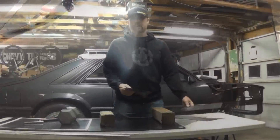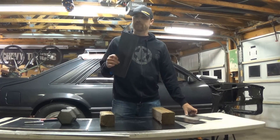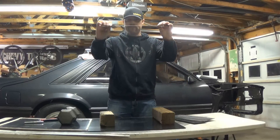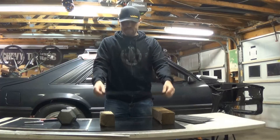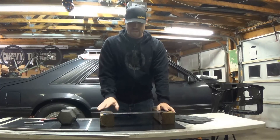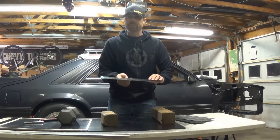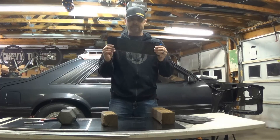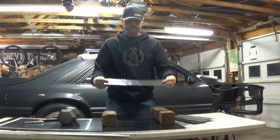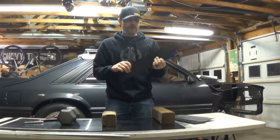I have the one piece cut into three pieces. All of these are just four layers of carbon fiber — two on the bottom, two on the top. I'm going to show you the difference in strength just based on the dimension. Four layers, carbon fiber, no foam — just a flat piece of carbon fiber. You can see the flex there. It should flex like that; it shouldn't be brittle. If it was brittle, it would be like fiberglass and it would just snap. That wouldn't be strong. If you heard it cracking, probably too much resin. You want that flex if it's just four layers of regular carbon fiber.